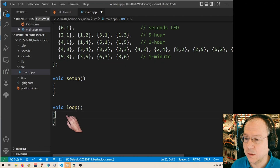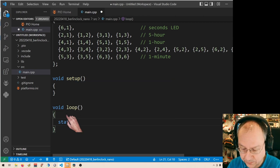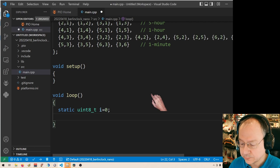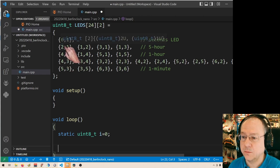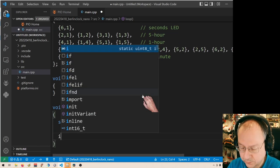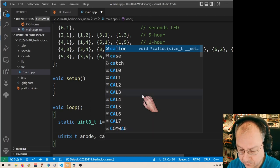So instead we go directly into the loop, and since this is only for testing, I will define a static uint8 variable i, which will be our running index through this array of connections. And now I want to switch on the first LED. So in order to do that, I need to know where the anode and the cathode are. So I have to go from here to the Arduino pin with a double index. So let's define two variables, uint8 type, anode and cathode,